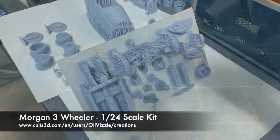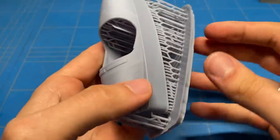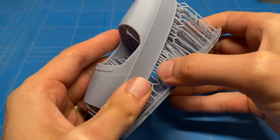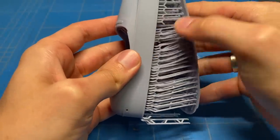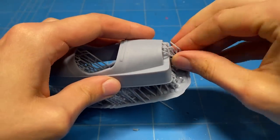The final batch of parts fresh out of the printer was also cleaned up and then moved onto the bench to remove all of the supports. I am removing the supports before I do the final cure on the parts, therefore the part still is a bit flexible and doesn't tend to break as easily as if it were to be cured already. So that is just personal preference and makes it a lot easier on me.